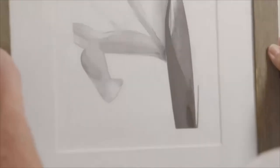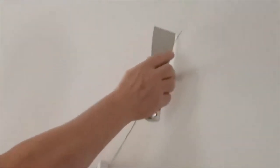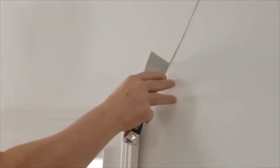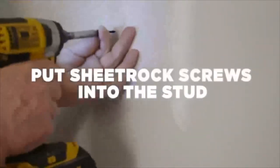Fixing minor holes and cracks isn't hard. If you plan to move or remove wall hangings, the holes should be repaired. Use a utility or putty knife to widen the cracks and remove any loose material, creating a trench that's a little deeper and slightly larger than the crack. Another common issue is nail pops, where sheetrock nails have popped up and now show. These need to be countersunk by hitting them with a hammer. To prevent it from happening again, put sheetrock screws into the stud on each side of the nail pop.